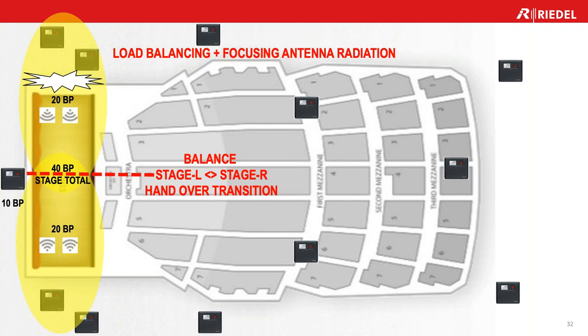Is that strictly level sensing in the belt pack, or is there something else going on? There's a lot of things. There's the idea of just bare bones generic signal strength, but there's also a very complex algorithm running in the background that's looking at distortion levels constantly. Every antenna is pinging every belt pack that it's servicing to understand its level of volatility, right? And the system is talking to every antenna in the system, and antennas are communicating. So the antenna on stage right is communicating to the software mechanism, and the antenna on stage left that's currently hosting that belt pack is as well.